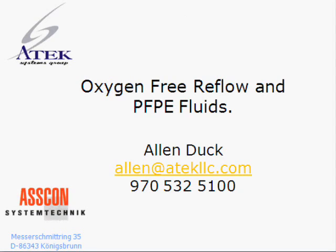Vapor phase without vapor obviously is not particularly beneficial, and unfortunately the vapor historically was a consequence of the use of fluorinated liquids, which were outlawed as a consequence of their ozone depletive characteristics. Fortunately those chemistries have been advanced significantly, and today vapor phase uses perfluoropolyether chemistry that allows us to create the needed vapors and provide the temperature control we desire without negative effects on the environment and atmosphere.